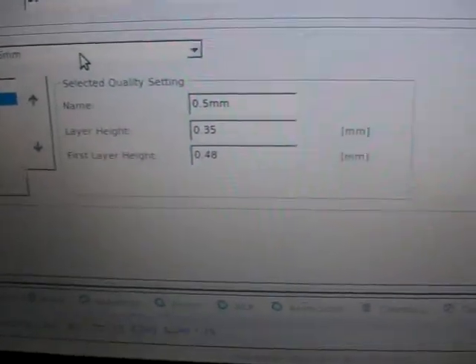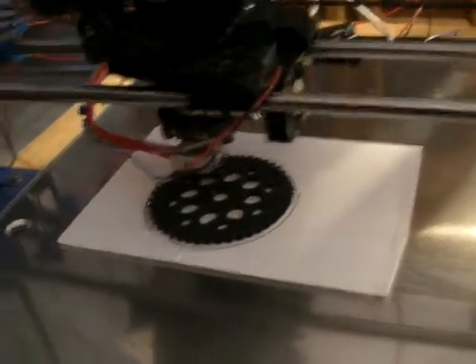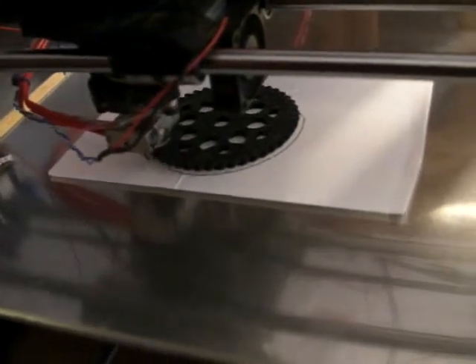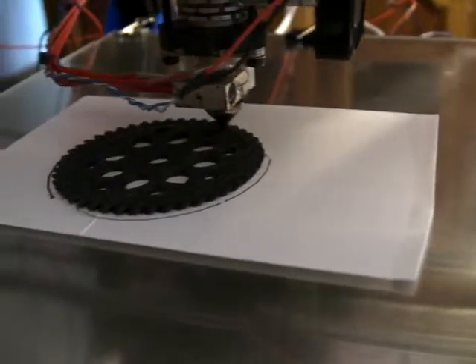For the profile I named 'just five millimeters,' the layer height between each layer is 0.35 millimeters and the first layer height is 0.48. What I've discovered is once I mechanically zero this to the bed using the set screw on the Z axis, I don't have to fool with it anymore if I know the thickness of the layers I'm putting on top. I'm using 4x6 non-thermal plastic-type shipping labels — you can run these through a laser printer, they come on a spool, you get a thousand of them. The bed is at 50 degrees C right now, and look — there's no premature warping and it isn't dragging around anywhere.